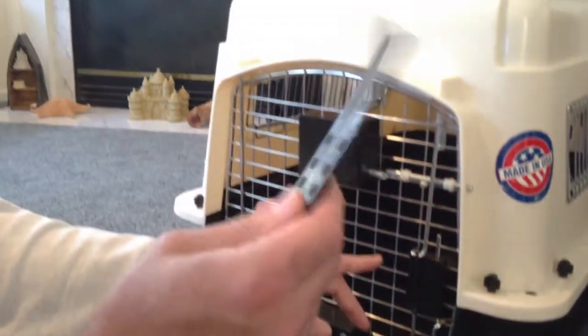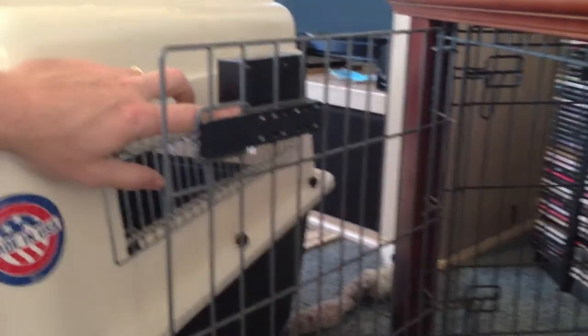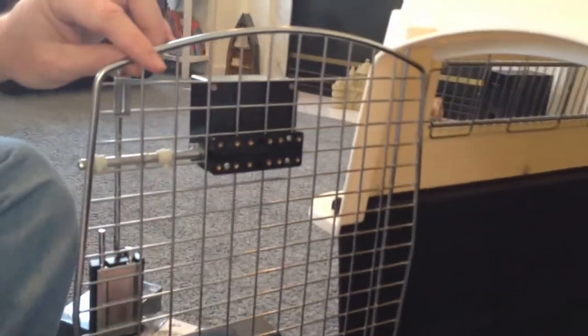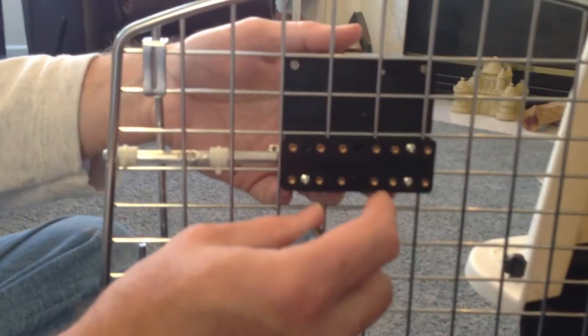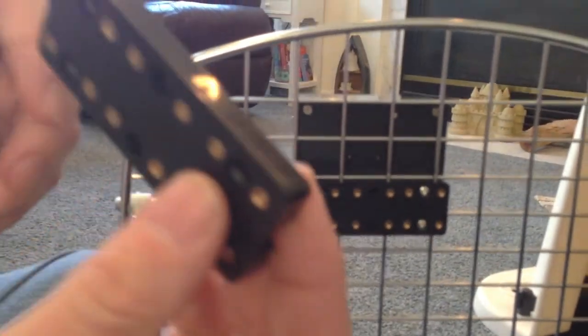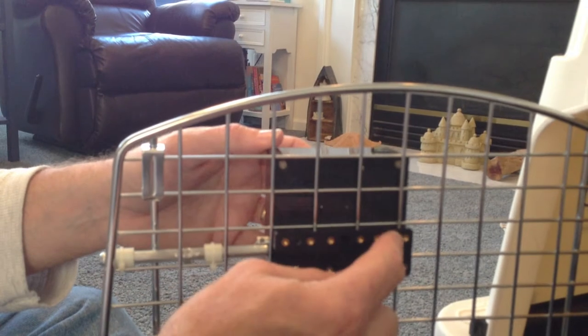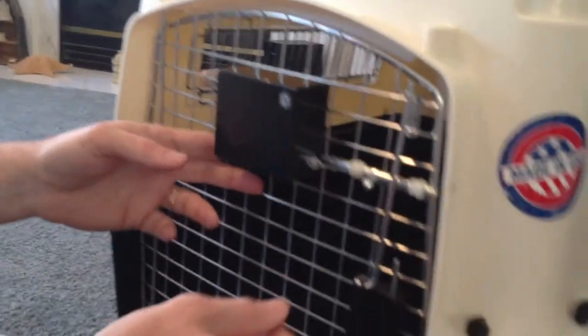This is the long plate. You also get a bag with some screws and stuff that you use to mount it. So what you're going to do for this application is disregard this long plate — just toss it aside — and you're going to remove this plate from the back of the box where it comes normally assembled. You're going to remove it by taking out three screws — there, there, and there — and then you're going to use it as the plate on the back of this door. You take those three screws out, separate this from the box, and then mount it with the door between the plate and the box, and put the three screws back. All you've got to do is figure out where to mount it on the door, and that's what I'm going to explain now.